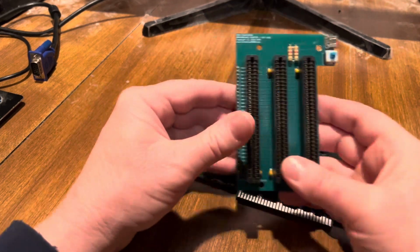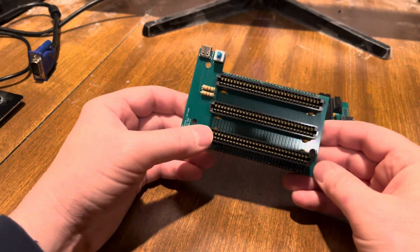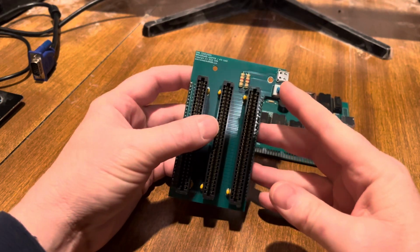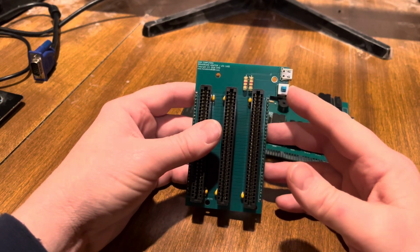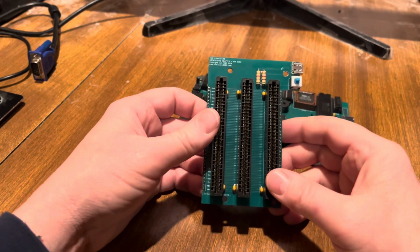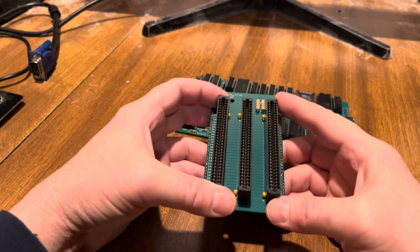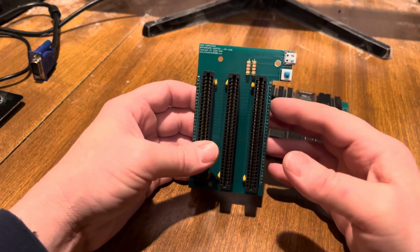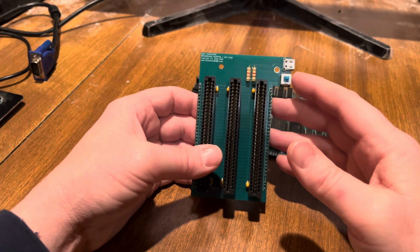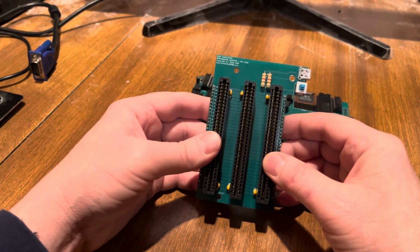It was just that one board, but that's another subject. So yeah, this is kind of a universal mounting 3-slot, goes into a breadboard, and we'll screw into an ATX case. Now, obviously, you're not going to access the power button in an ATX case. My intent was to just leave it down and then just plug it into the wall to power the system. This is meant for prototyping, really. You plug it into a breadboard, and you can build off of those pins any prototypes, and we'll get into that here in a minute. And then you can just turn it on and off as you prototype with it.